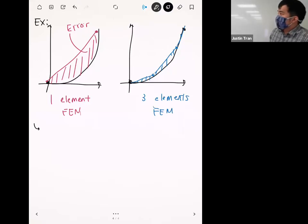And so there's always, no matter what kind of finite elements you do, going to be this correlation between how big your elements are and how accurate the solution is going to be, okay? But element size is not the only factor. Besides element size, there are also things like the element shape, the skewness, and the topology of the geometry. All of these things contribute to accuracy. But out of all those things, size is most of the time going to be the most dominant factor, okay?